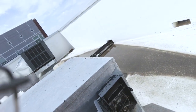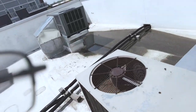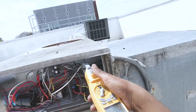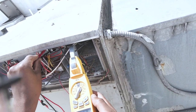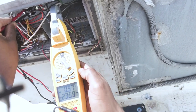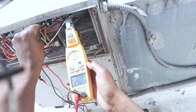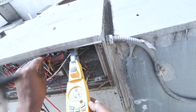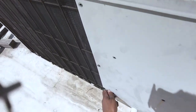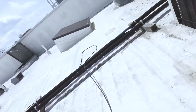Run it — nice, keep rocking. There we go — 11.5 amps. Check our power factor — 0.97. Looking good. We've got 0.98. 2,383 watts.